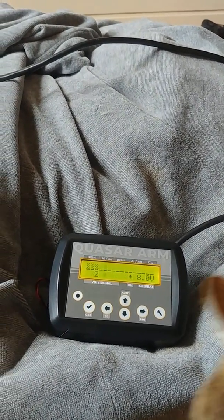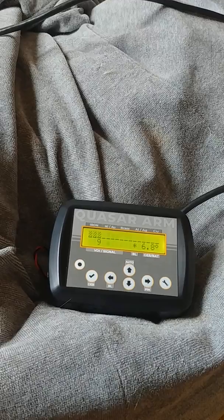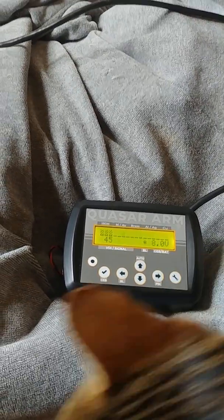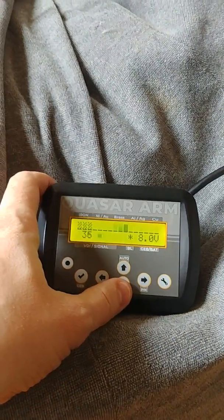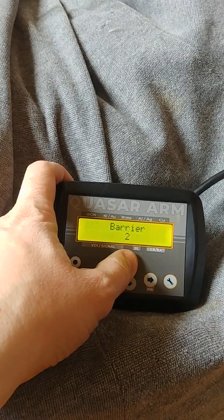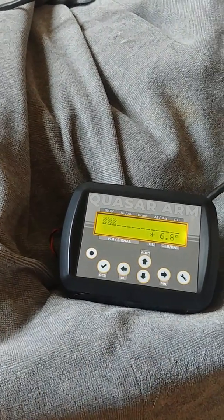This is a very fresh, latest version and it has maximum sensitivity, but sometimes it can be a little bit more noisy than older ones. Some people prefer very old firmwares from a couple of years before just because they are less noisy. But there is a way to make this unit less noisy. Right now we don't have a coil connected, and the unit is generating some noise — not really much — the barrier is 2 and we are in the building, so this is a very good result. Barrier 3 will be almost silent.